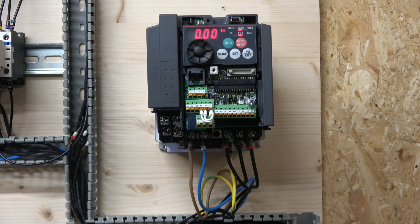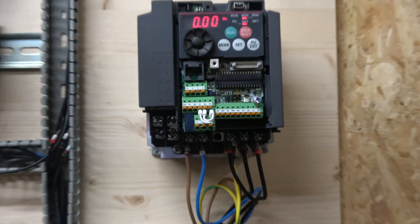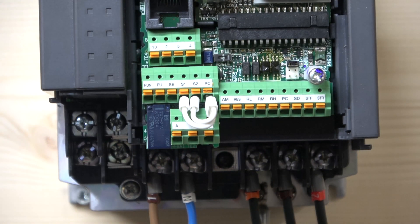So now the drive is set up, let's have a look at the wiring. First thing we're going to look at is this is a 1.5 kilowatt single phase drive, so it only needs a live and a neutral. Live will go in the bottom where it says L1, and the neutral will also go accordingly where it says N. Three phases down here will go down to the motor and earth as well.